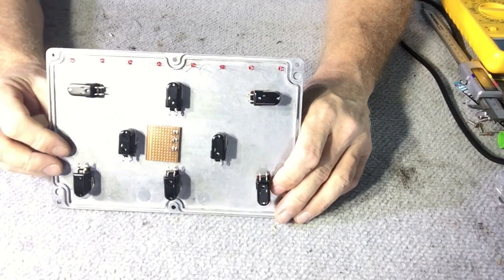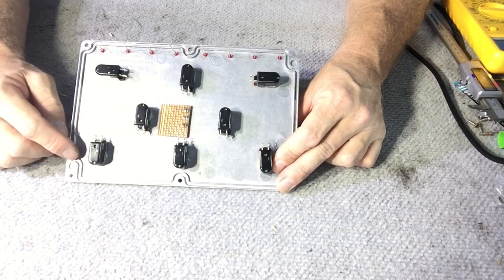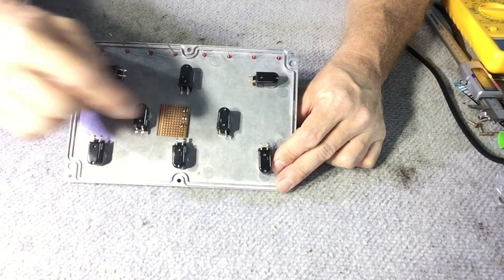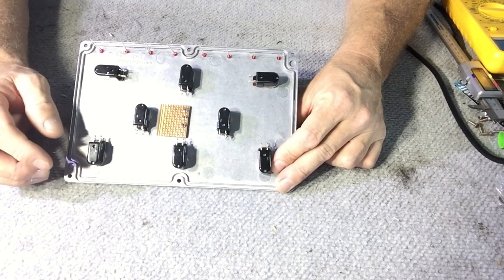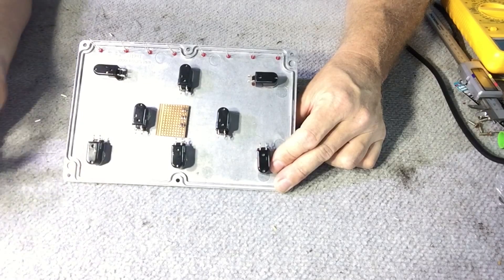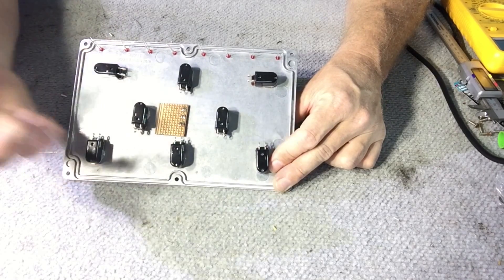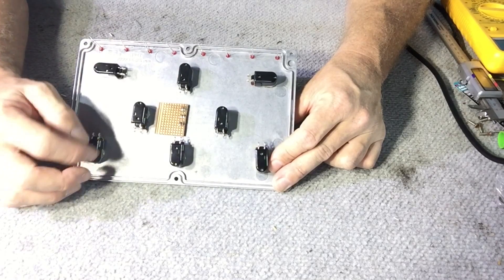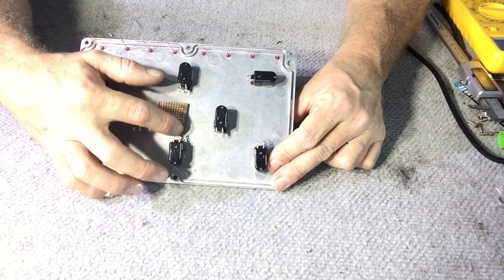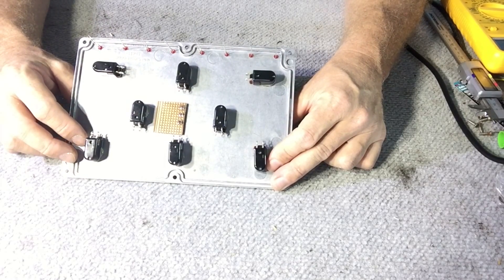If we go over to the back of the panel, you can see the back of the switches. I will make one leg on each of these switches common and connect them all to ground, and then all of the hot or active sides of the switches will go to each pin on the Arduino board to actuate the programming. For the 3 LEDs here, I've got the stripboard in here and I can run the resistors across. I've also run them so one strip is common for the negatives.